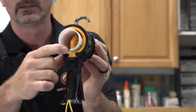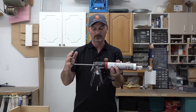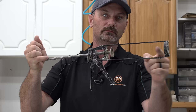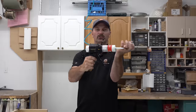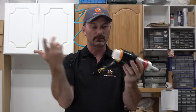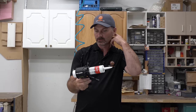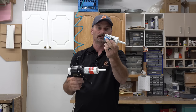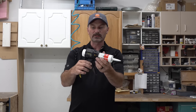They've got to do that, right? With the old traditional ones, there's a rod with a plunger on it — here's a better look. When you squeeze the handle, that plunger goes into the tube; there's no reason to split the tube. This one works the opposite way — you're shoving that tube through the gun, so they've got to split it. Not a big deal. It actually helps the gun get even smaller once you get going. As the caulking gets down, you can cut the ends of the tubes off out the back and you can really get into some tight spots. But that's the basics of how the gun works — it's still pushing out caulking.